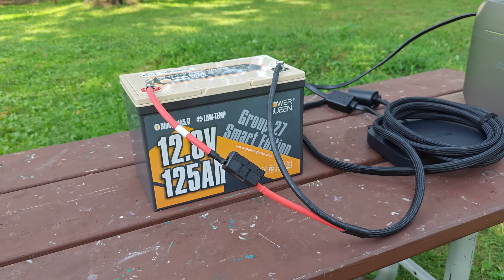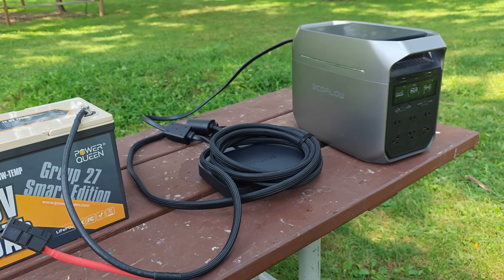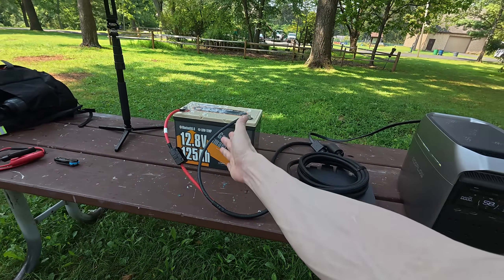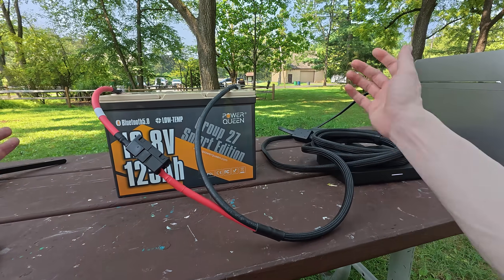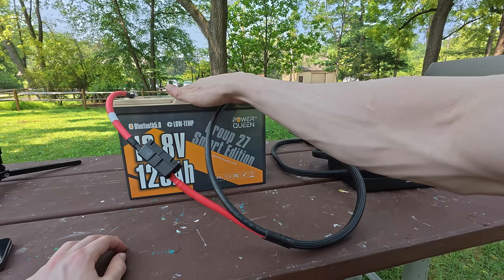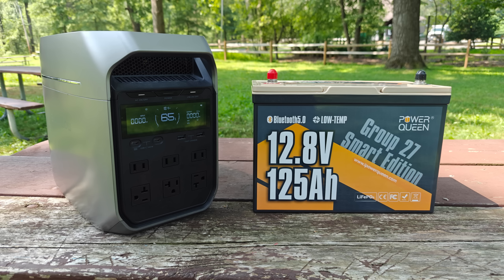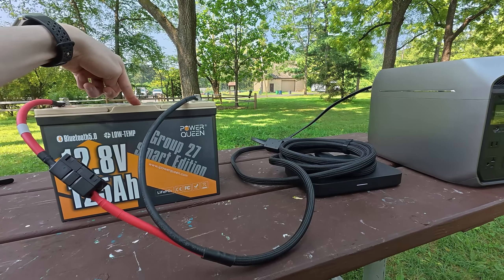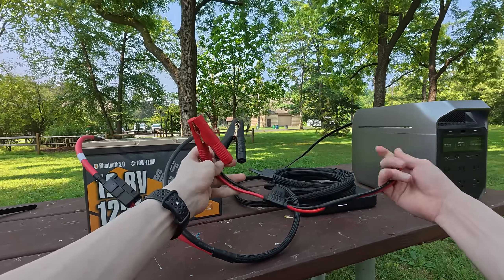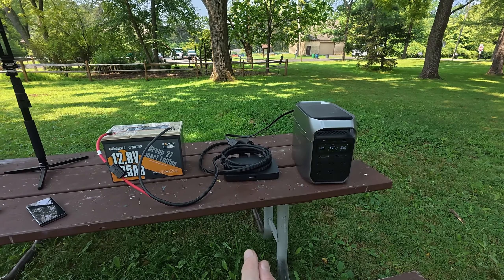The way I've been using this setup is that when I'm charging via regular AC power, that's when I activate the reverse charging to charge both batteries. Then in a situation like this, when I'm not charging, I can send power from the secondary battery to the main unit. You can do this with any 12-volt battery, but Power Queen did send me this battery to make this test possible, and I do think this is a really solid option — it's highly rated, it's lithium iron phosphate, and it has that mobile app, which I think is key for this setup. I'll go ahead and leave this battery linked below the video to their website and Amazon page, and I'll link other options like this XT60 cable if you want to go another route. If you found this video useful, I appreciate a like and subscribing, and I'll see you guys in the next one.